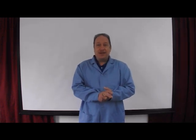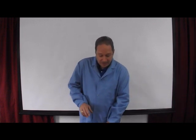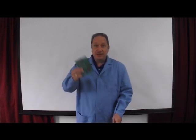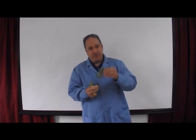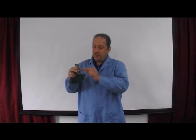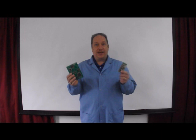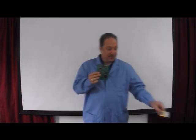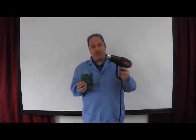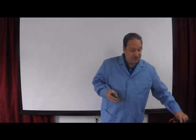If I'm evaluating a system and I go to see a demo of a BGA rework machine, we don't want to see them give me a demo on a little bitty thin board, or a little bitty cell phone board with really small chips. I don't need a $20,000, $30,000, $40,000, $50,000, $60,000 machine to remove chips off these type of boards. I can go get myself a hot air gun at Harbor Freight for $10 and it'll remove these chips just as good as any expensive machine.